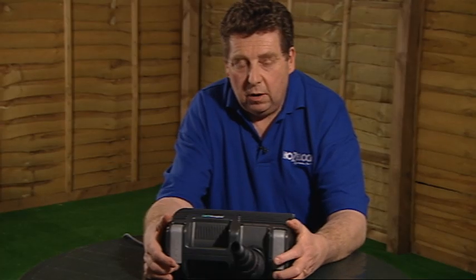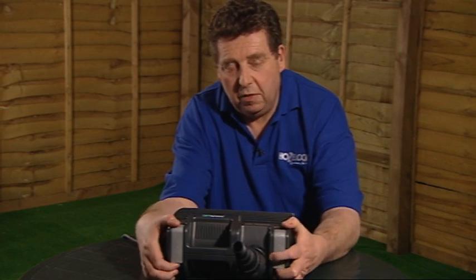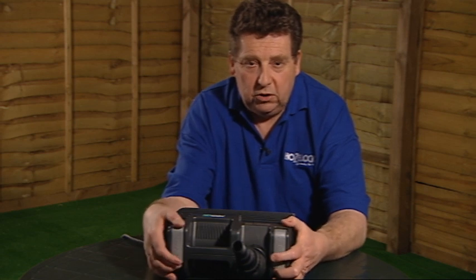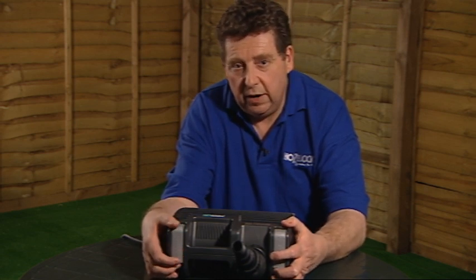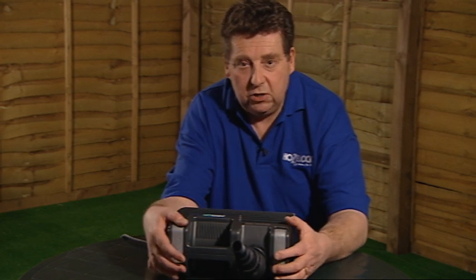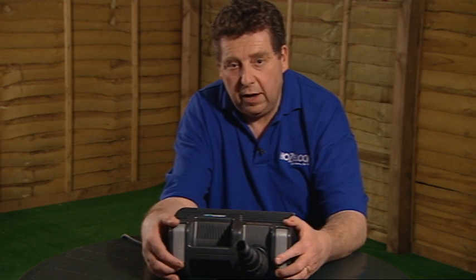So in this video, I'm going to take you through the stages of how to remove the Aquaforce 1000 rotor from the pump. We're going to check it over, make sure there's no excessive wear, and then refit the rotor back to the pump and the pump back into the cage. You won't need any tools at all to do this. It's all done by hand.